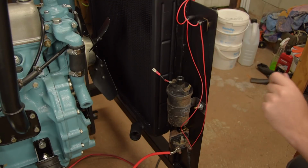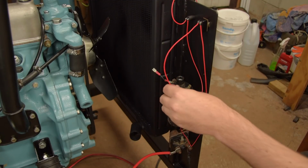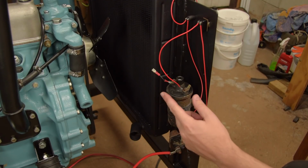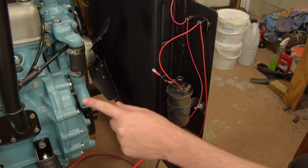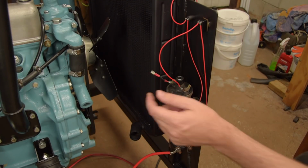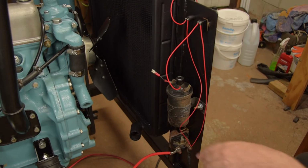this is the back of the switch. When this is on, we want to feed power through here down to the ignition coil here. Now I haven't got it hooked up yet because I don't have a long enough ignition lead, but that lead will go over to the distributor on the motor, and this will go to the condenser in the motor. So in other words, when this wire through the switch is live, the engine has ignition.